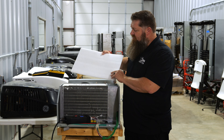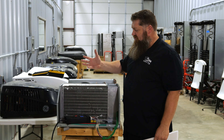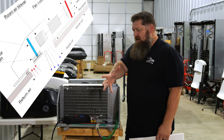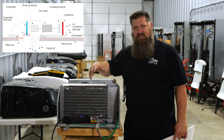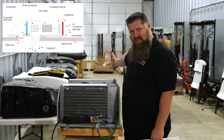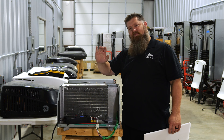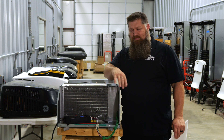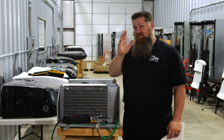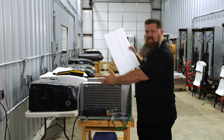I'm going to take this small piece of styrofoam and put it behind the coils. With a standard air conditioner, there's a fan motor back here that draws air through the evaporator coils. This is where the cold refrigerant is — there's a heat exchange while there's hot air inside the RV. But what happens when we go ahead and clog this up? Why do I need to clean the coils if I'm just changing the filter? A lot of dirt ends up getting past the filter and accumulating here.